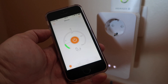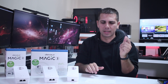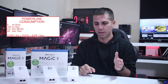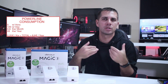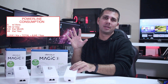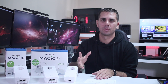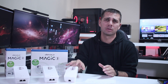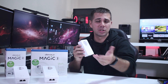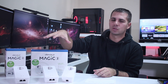In terms of power consumption, 5 watts per device means in one day we spend 120 watt-hours, in one month roughly 3.6 kilowatt-hours, and in one year about 43 kilowatt-hours — which where I live comes to more or less 8.6 euros. Now, 5 watts is the maximum I could measure; when not in use they go to sleep and consume a bit less, and if you turn off the LEDs they consume even a little less.